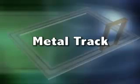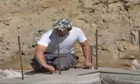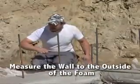Locate the outside building line and strike the line. The building line is the outside of the foam. Remember to account for the 2 1/4 inches of foam on the outside of the wall.